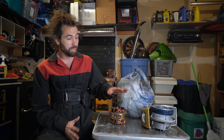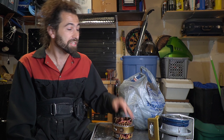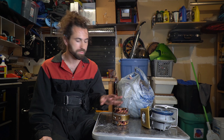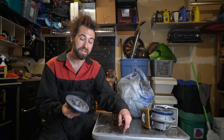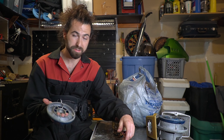All right, well that's the data — what do we make of that? Honestly, I was expecting to come away from this convinced this was a huge waste of time. I actually did believe the guy at the scrapyard. But of course it's a waste of time if it's not actually copper, so check and make sure they're not aluminum windings, and if it's any smaller than the three that we looked at, I'm pretty sure it's a waste of time too. But I was actually kind of surprised at the blue one — the first one that we completely got all the windings out of. It did take about an hour and a half of fiddling to get all the copper windings out, but it was about $7 worth of copper. At that rate it's definitely not worth it, but if you could process more than two of these in an hour, then I would say that is worth it.